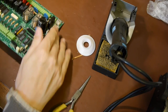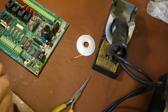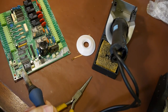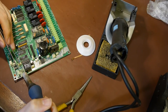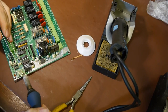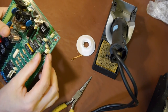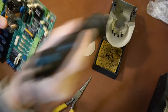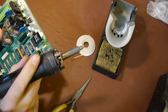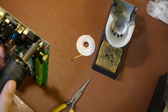I don't live well enough to repair this board - I've got a feeling when I looked at it when it originally failed, I came to the conclusion that the failure had actually managed to put 24 volts on the rest of the logic. So I think we're probably on to a non-starter. I'm just pulling the spider's legs off one by one at the moment. I'm wondering if I'm going to have any more success trying to suck from the top side - there looks like there's a ground plane on top so there's less tracks to destroy.